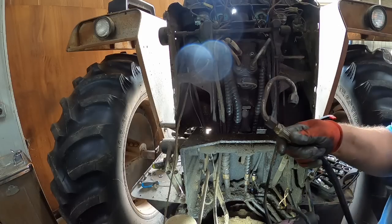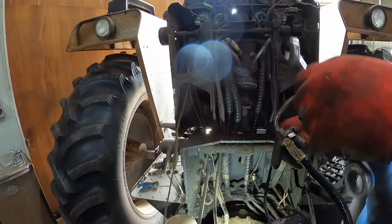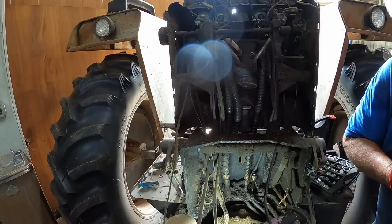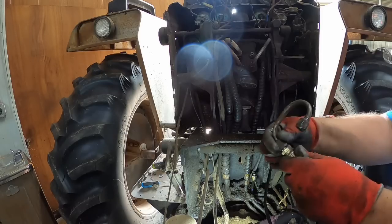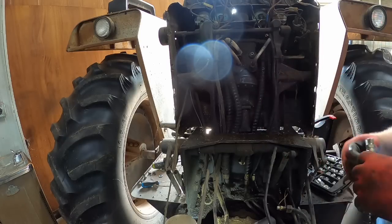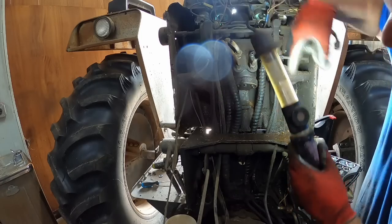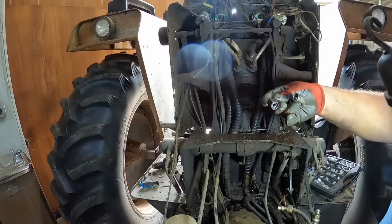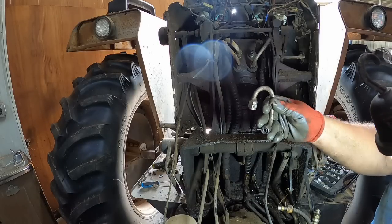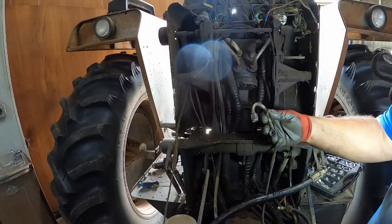And as I was mentioning earlier, someone took the original steel end of the line. Probably doing it off camera, pulling a Ross on you. The original steel lines, the original hoses, you would see it there, went right into a crimp. Someone took the original and made a flare fitting on the other end. And it's working. I like that, because I think I'll have to do that in the future. I can just make a new hose with these fittings on it. Straight hose, easy fittings, save a lot of money.